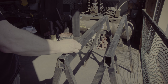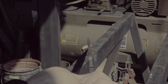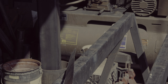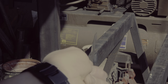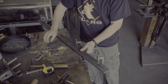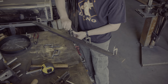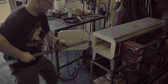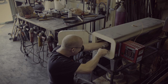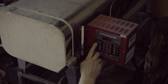It looks like the sword came out successfully and did not break. A potential problem could be a crack in the blade, but bending and warping are quite common as well. In terms of cracking, it looks rock solid. Unfortunately, the blade developed quite a severe warp both on the back and on the cutting edge. I will show you my secret trick of fixing this the easy way — it requires a straight solid bar of steel and a bunch of little C-clamps. The idea is to straighten the whole blade against the completely straight bar and run another round of tempering. This is something I usually do after having already tempered the blade. If my memory serves right, I probably did the initial temper at 400°F or so.